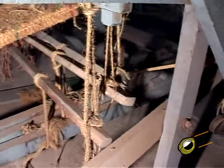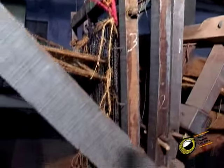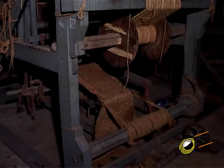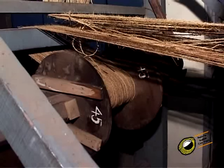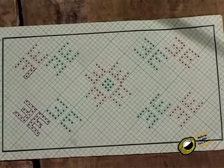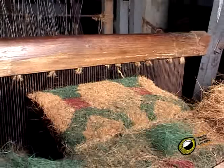For weaving fiber mat the loom requires three heddle frames and three treadles. The tight and slack warps are prepared separately on two chain beams. The tight warp at maximum tension is used for inserting the fiber tuft. The slack warp at lesser tension works as the binding chain and offers a sturdier construction for the base fabric. The binding chain interlaces firmly with every peak in the mat and wraps around the bottom part of the fiber tuft, so the peaks between every row of piles are firmly held and the bottom part of the fiber tuft is completely concealed. Draw the design to be woven on the fiber mat on graph paper for choosing the color of the weft while weaving. This loom sketch of design facilitates easy weaving of the fiber mat of the same design by different weavers.